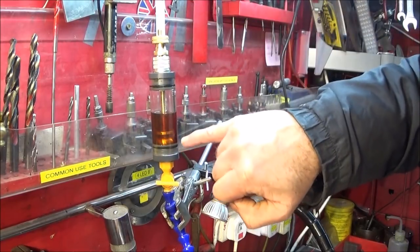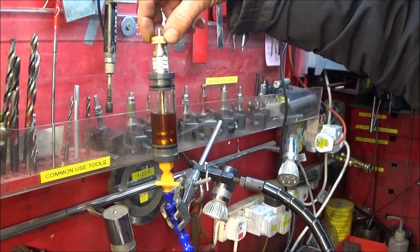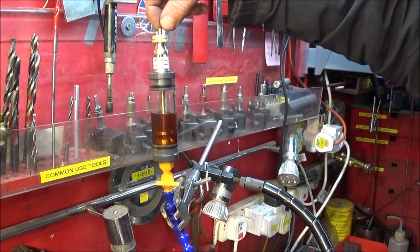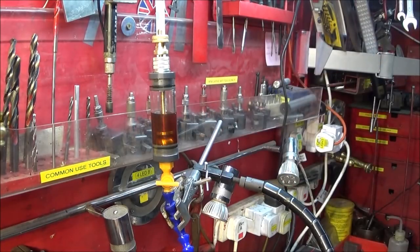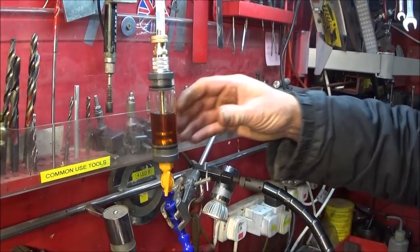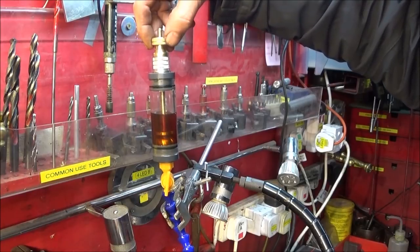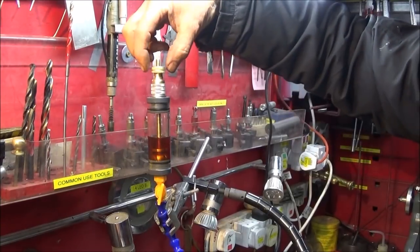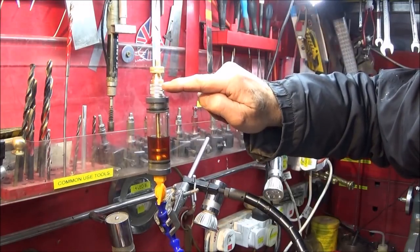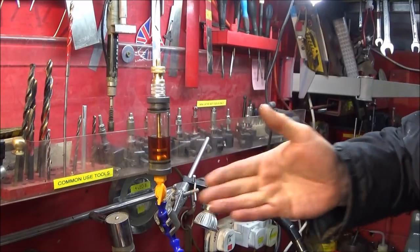The valve inside is very simple — it's a brass ball which I got off the front of a fireplace. It sits on brass studding, and before you turn the tap on, you make sure the screw is up so the weight of the ball goes down onto the cone and stops any flow. The knurled adjustment collar screws down on the studding against the face of the aluminium, which lifts the studding and lifts the ball valve off the cone seating to allow the flow of oil.